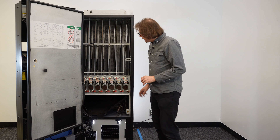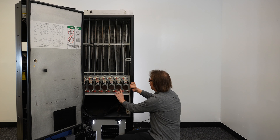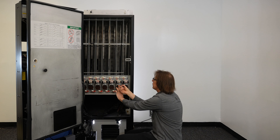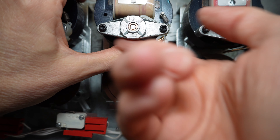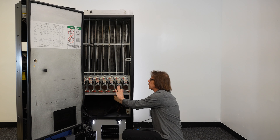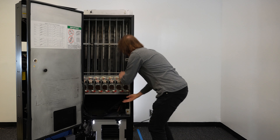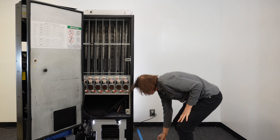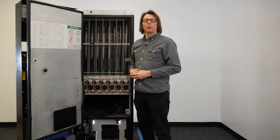Once power is removed, we come back over to the motor and we need to open the cradle up by hand so we can get that pinched can out. I typically use my ring finger or middle finger and index finger — I'll push down on the actual home switch, then push up on the brake, and start turning the cradle using the armature. I'll spin the armature clockwise or anti-clockwise depending on whether I need to open or close it to get the jam removed. There we go — can's nice and clear. Reach in and remove it.